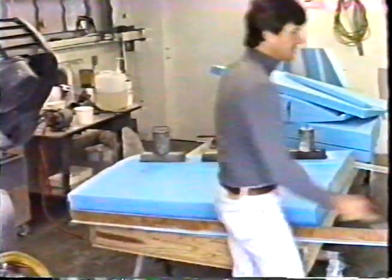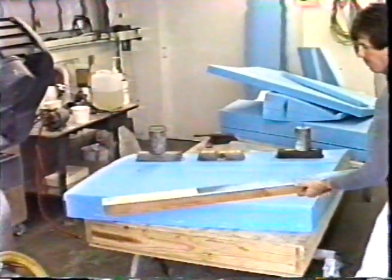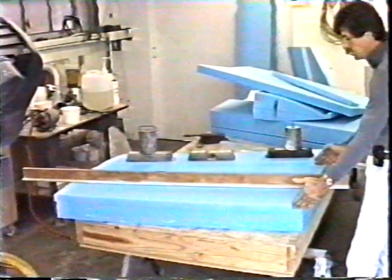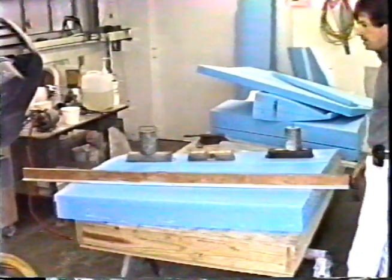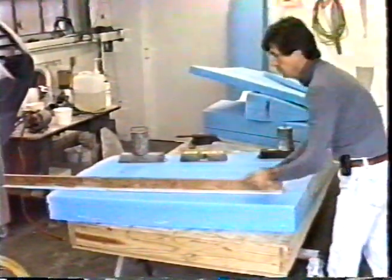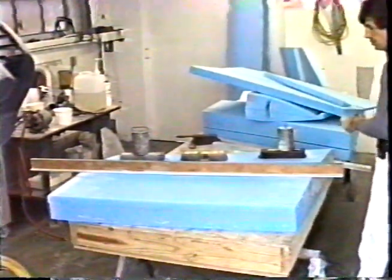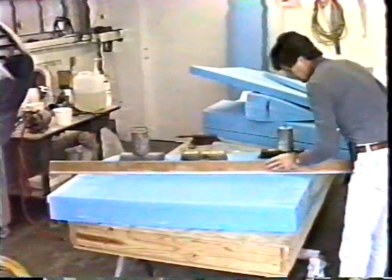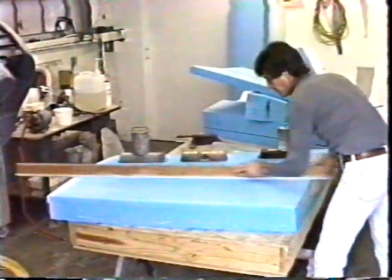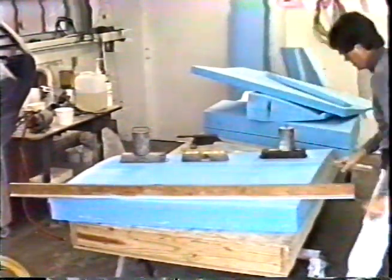Now we're going to start the sanding process here. And we have this sanding bar with one end that's without sandpaper. We have almost twice as much surface area here as we have on the outboard end. So we're not going to spend as much time out there with sandpaper as we would on this. I'm also not going to put as much pressure there so that I sand that area slower. Well, we certainly know we don't need to spend any more time here.